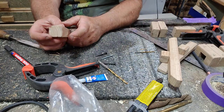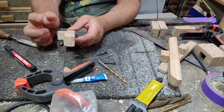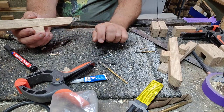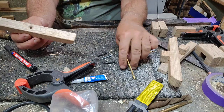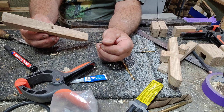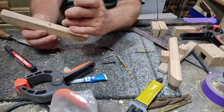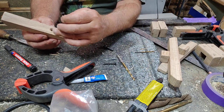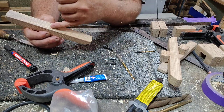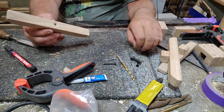You don't want to be using a great big screw or one that's too long or right to that edge, because you're likely to split it. But that's not the trick. Wherever you've got a countersunk screw, always countersink the hole — put a countersink like that so the head of the screw can sit neatly into that countersink, otherwise the screw itself is going to try and split the wood. I've countersunk it anyway with this countersink bit.